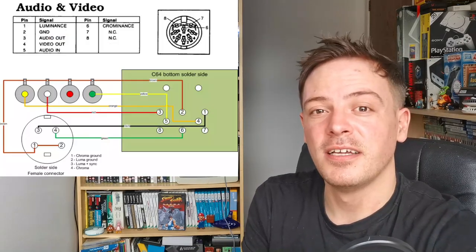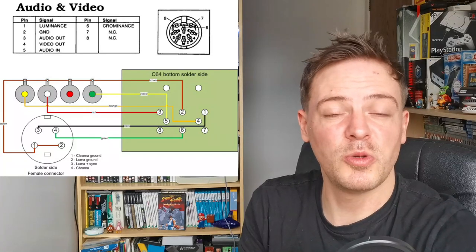Now a bit even better quality was the S-video. Again, not really popular over here, and especially with the Dreamcast as well, but with the S-video, it actually split up the whites and the blacks and the colors, so you got even better image quality from that. But again, the jump wasn't that great. And even better again, you had the RGB SCART, and that is very popular and people are still very happy using the RGB SCART, especially if you're using a CRT TV.